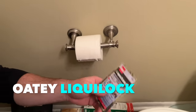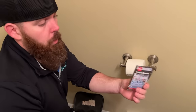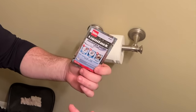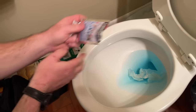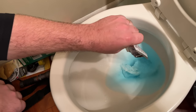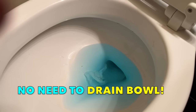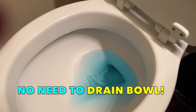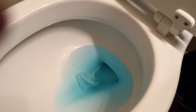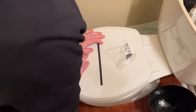Here's an interesting product — we don't have to drain this toilet fully because we're not replacing it, but if you were, you could use this stuff to make that task much easier. Just sprinkle it into the water and it will start to absorb that water like Orbeez, turning it into a nice solid gel surface. Then you can just lift the toilet away without a bunch of water spilling out, and it's flushable.